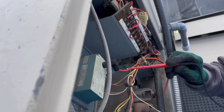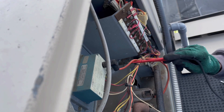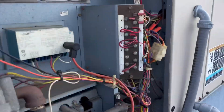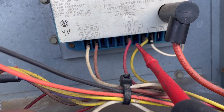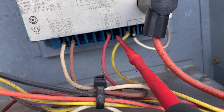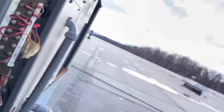I'm going to order up a new ignition control module and a spark ignition wire. If you look very carefully, you can see that green light — watch it flutter. It's bad. That's your problem with this one. Now I've got to go take a look at the other unit.